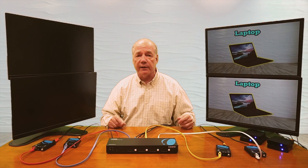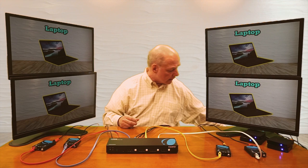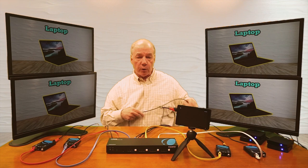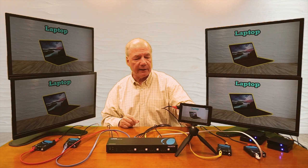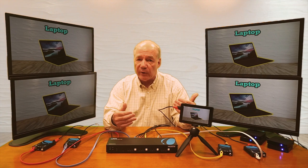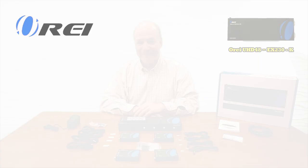One of the really nice features of this product is the local loopback functionality, which allows you to mirror what you're broadcasting to the remote locations here at the primary location. I have a small monitor here and I'll connect that up to local loopback number one — it will show the same image as what I'm broadcasting to the remote locations. The matrix is also smart enough to adjust the resolution and frame rate as needed to give you the best possible picture on each monitor, so this smaller monitor with different resolution still receives the correct signal. It really is just that simple to get it working.